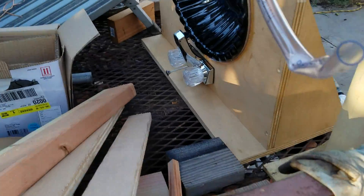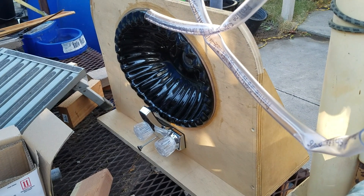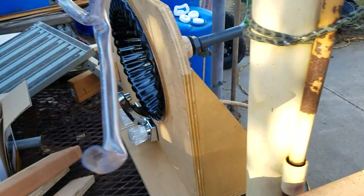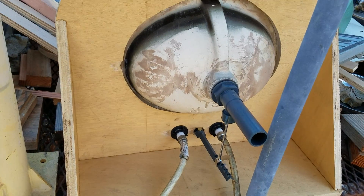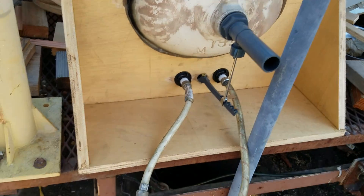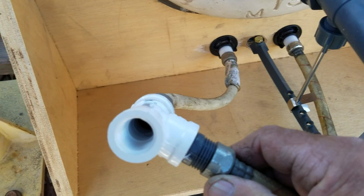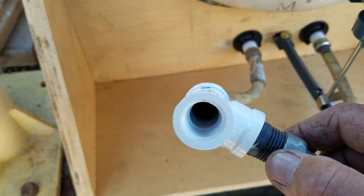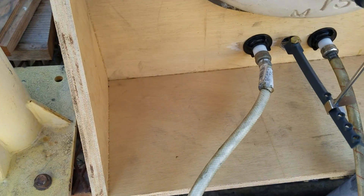And this is my sink that's going to mount on the outer wall of my shower. I've got the faucet and the sink in place. You'll see the lines in here and the drain and so forth. Right now I've got the two lines connected with a T, because I'm not going to put hot and cold water here for a temporary run — I'm going to be using just the hot water running in here as a test to see what kind of pressure I get at the faucet.